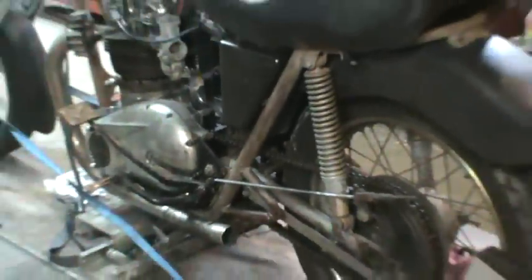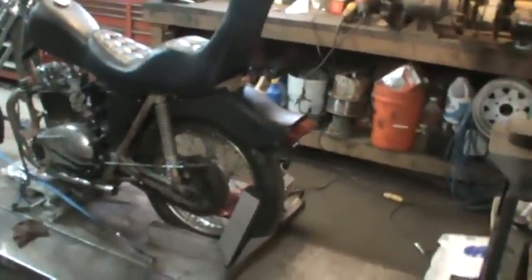I was a little overzealous on that notch, but I'd rather have extra clearance. I've got to pop that fender back out and flip it upside down. We were trying to figure out: does it stay exposed or does it tuck right in? He mailed me a picture of what it's supposed to look like — the lens kind of pops out just a hair past the lip with a fairly decent-sized gap going around it. Looking at the aftermarket fender, the light is level but the fender is going down on an angle.